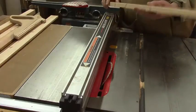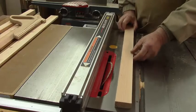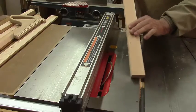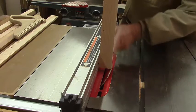Kind of like that tray that I built here a couple of sessions ago. And so I'll start out at the table saw — I'm going to cut a 45-degree angle on one side of this seven-eighths inch by two-inch piece of wood. I've kind of stumbled onto an idea here for figuring out the depth that I want for the saw blade to cut so that it will come right even with the corner and then 45 degrees back underneath.